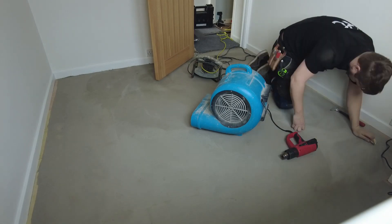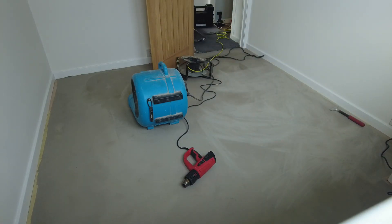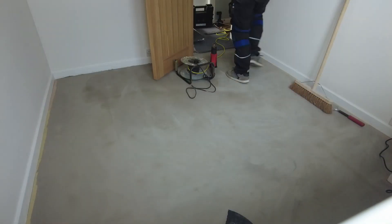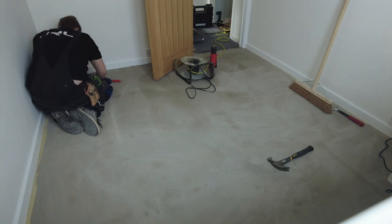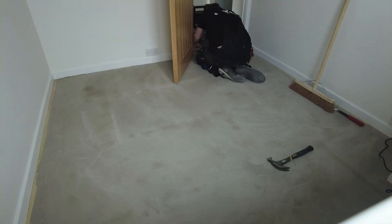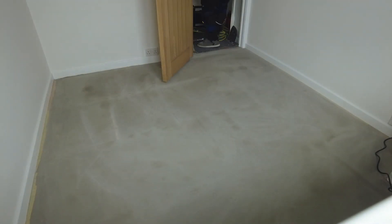Now I give it a good sand over - make sure all the joints are perfectly flat, address any bits missed with the stapler, and if I see any ply moving I'll fix that. I want it as smooth as possible as a platform for the tiles. Using a big chunky piece of sandpaper. The customer's asking what I'm doing - I say I'm filming, ask permission, and they say they'll subscribe because I'm amazing. Give it a sweep to get rid of all that dust.